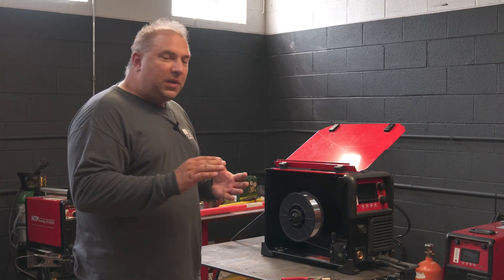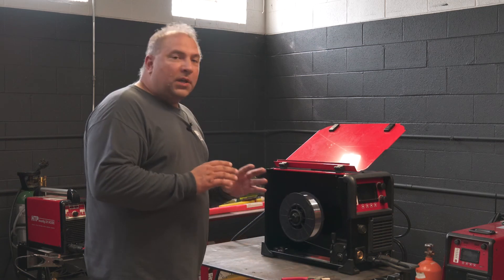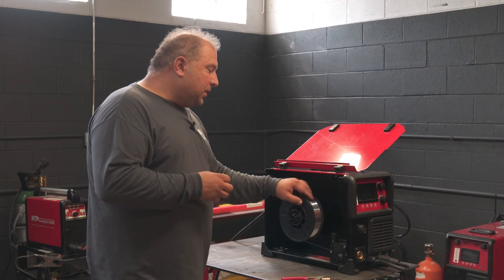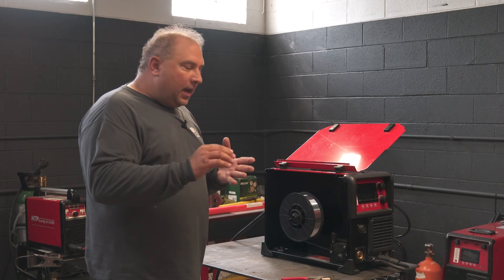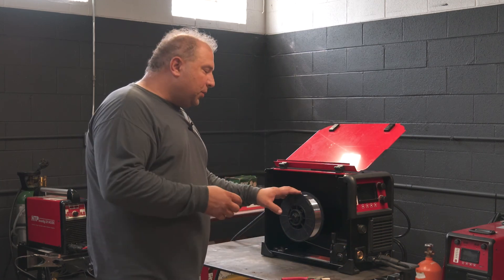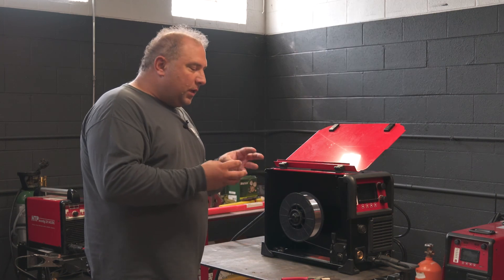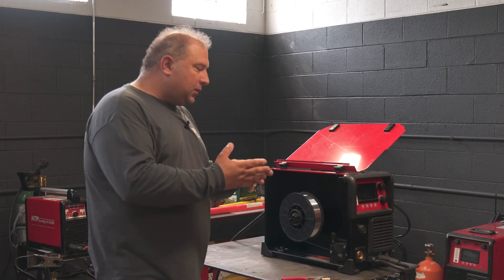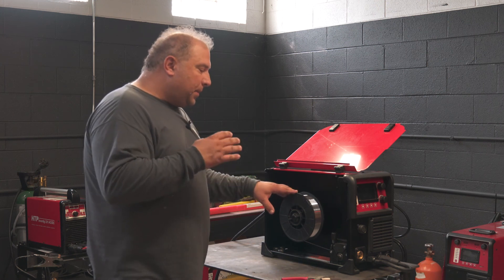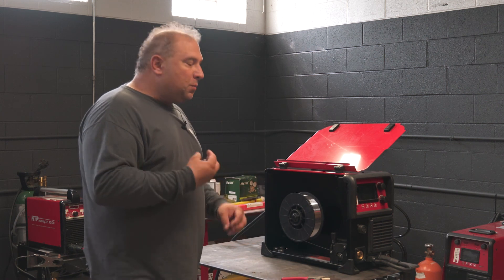If you have a large wire spool with lots of weight and very little drive roll pressure, you don't want the wire to slip — you want it to feed good. If you increase the drive roll pressure too much on soft alloys like 4043, you're actually deforming the wire, making it kind of diamond shape, disturbing the surface finish. It will hang up in the liner, come out corkscrew, create more contact points with the liner, and feedability is lost — including where it goes through the contact tip and is supposed to accept the electrons. The surface finish and surface area is reduced, so nothing good can come out of drive roll pressure being too high for any kind of wire, but everything is more critical on aluminum.